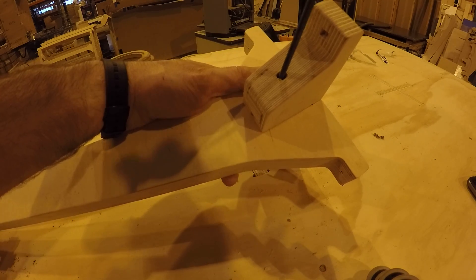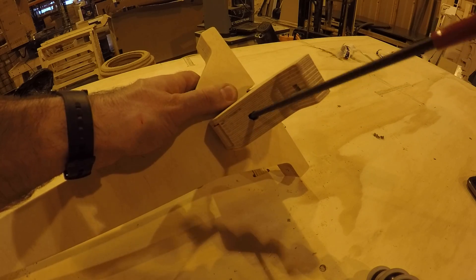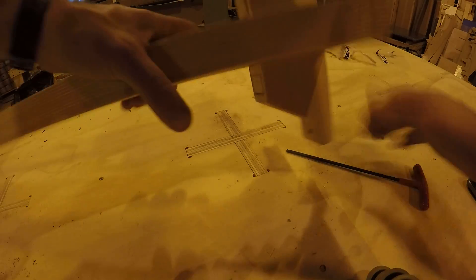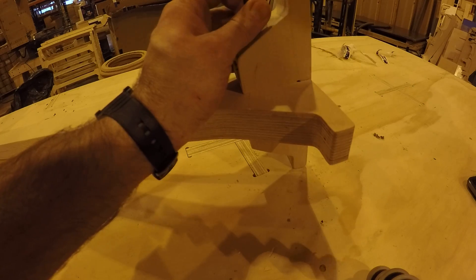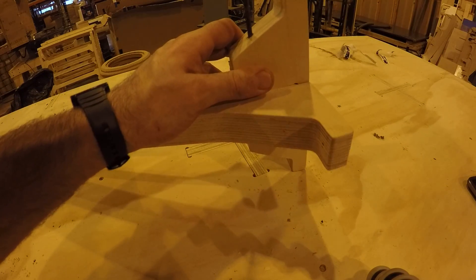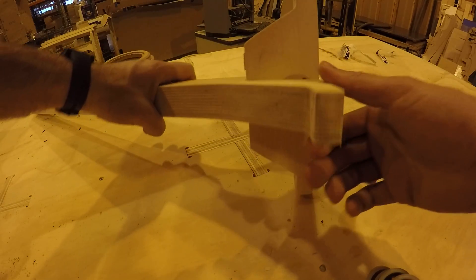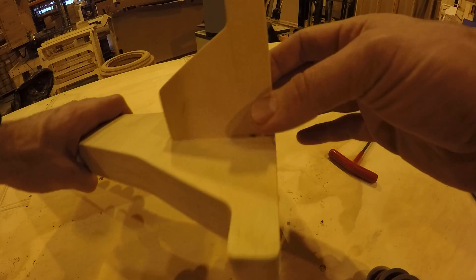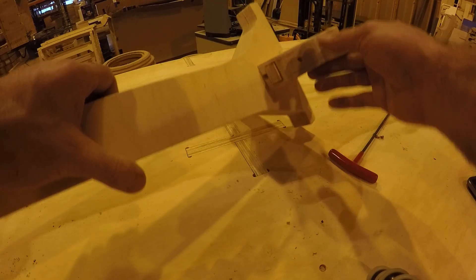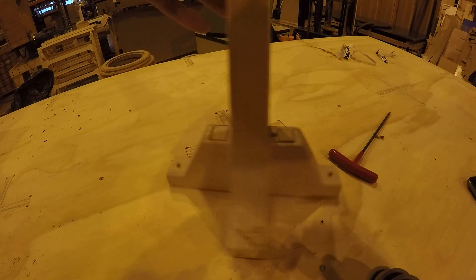It's set up so that the length of the bolt can actually vary quite a bit. We tighten this up, get it all straight, flush at the top — give it a couple turns. You can crank down as tight as you want. And now we've got a completely solid cafe table leg that you can cut from any plywood thickness, which is great, and it installs together in seconds. The only hint that something's going on is this little hole and these little things on the bottom — but since this goes up underneath the table, there's no visible indicator.